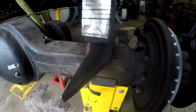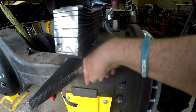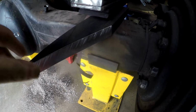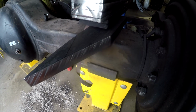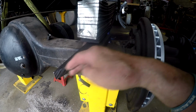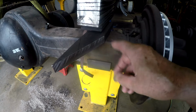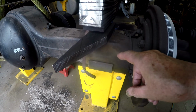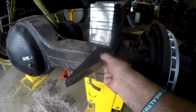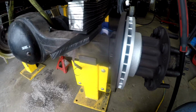I have U-bolts that have got to go over this thing. When that spring comes down and gets centered into that pin, the U-bolt's got to come down, and what would happen is the U-bolt would pass this plate in a location where the weld would be on that 22.5-degree angle. In other words, when I cut this, originally I cut it for a 45-degree angle, having it way back here. And when I cut the 22, it extended it way in towards the axle. And I don't really want that U-bolt crossing the weld location on this plate. I would rather have virgin, unwelded plate where the U-bolt goes down through, and have the weld behind that, or proud of that U-bolt.